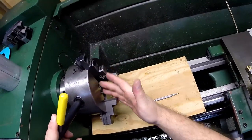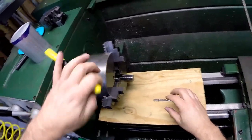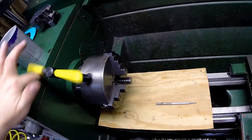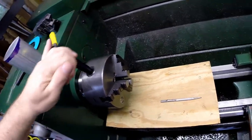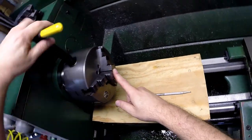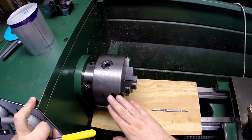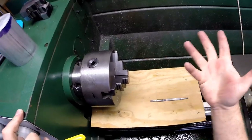This is the most extreme position the jaws can be in — never clamp anything with the jaws out this far. Push them in. If you did this wrong you'll know right away: when all three come together they won't come together equally. I keep jaw one matched to slot one, and while it may not be critical, it's not a bad idea. You do have to go in order one, two, three — otherwise they will not come together and the chuck won't function.